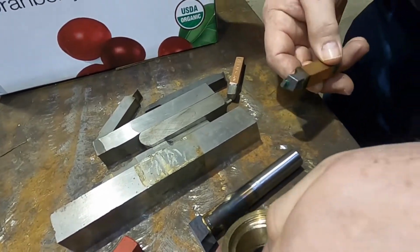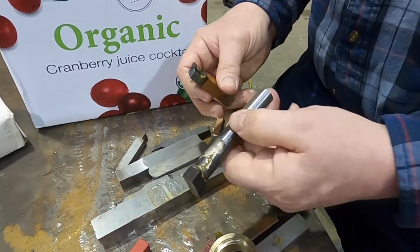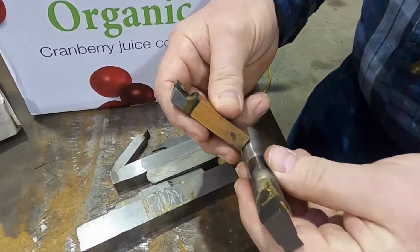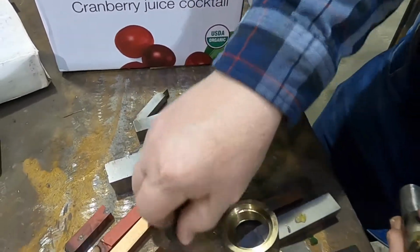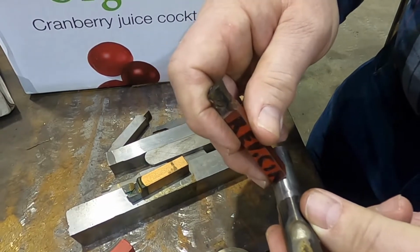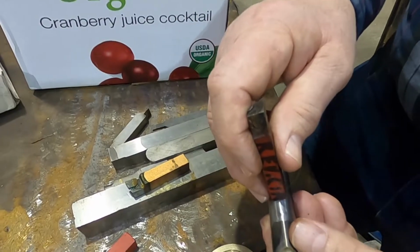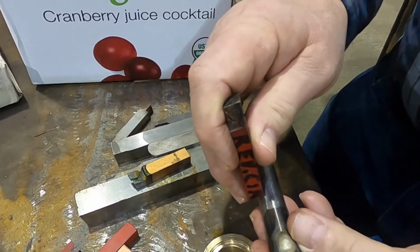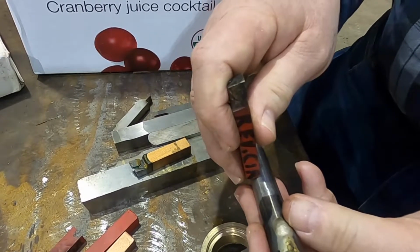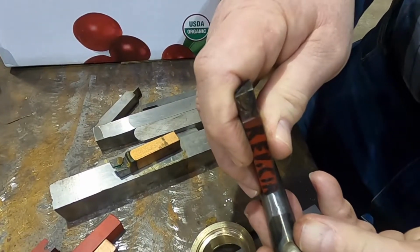And the reason for that is in line boring. You're out in the field, you're reboring something, you will have, I should have had a bigger piece of shaft here, but this is the general idea. Imagine for a second that this is the one. So you have a square hole that's cut in this tool, in this driver bar, and this will be turning around to cut holes. So since you can't cut it offside, if you cut it way off to one side, now your bar is in two, essentially here. It's going to bend, it's going to flex. You have to cut your hole in the middle of your bar.